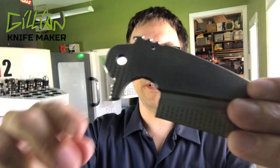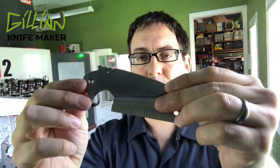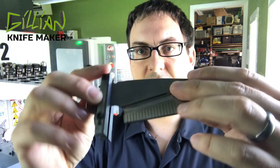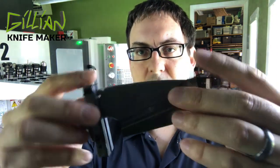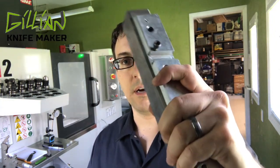In a previous video I showed how I machined my blade blank. From here you need to put on the bevels. There are a few things you can do. One would be to freehand grind — the problem is it's very hard, it's an acquired skill. If you're a maker with a day job making knives on the weekend, go for it and learn to freehand. But if you depend on knife sales to feed your kids, make a block jig and grind with a jig. I do use a block jig and I'll show that in a future video.